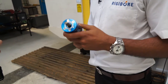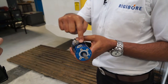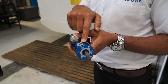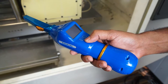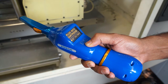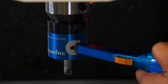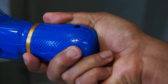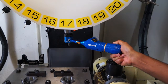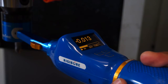How do we do this? This is the SmartBore nano head. In this nano head you see the terminals here. This system is controlled by a SmartBore handheld digital adjuster — basically a digital torque wrench. We locate the digital torque wrench in the connections here, turn it clockwise and anti-clockwise. A positive or negative adjustment is done on the cutting tool, which can be read out on the digital display. Remove the adjuster and you're ready to cut.